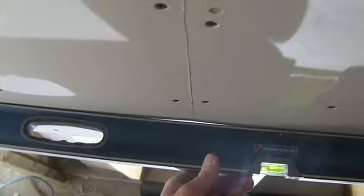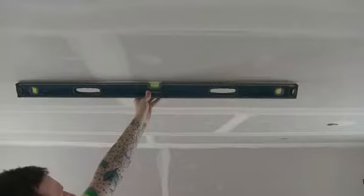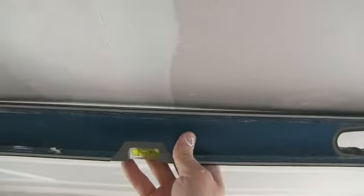Installation is simple. Instead of cutting your drywall sheets shorter to land on a stud, simply let them float in between and scab in a piece of Butt Board. This saves on time and drywall waste. After your piece of Butt Board is properly installed, you will be left with a nice recessed joint. After your tape is applied, you are left with a small recess to fill.